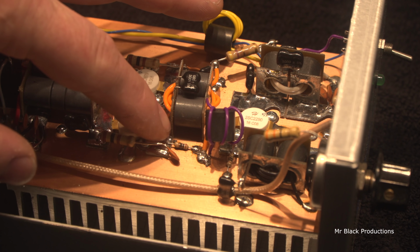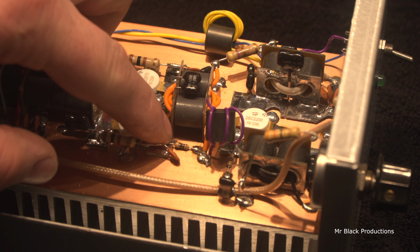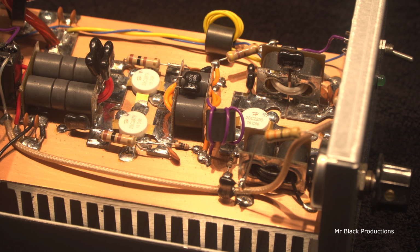But the electrical smoke indicator, this resistor right here, has gone bad. Now, if you've been around this game for a hot minute, like more than a week or two, somebody will inevitably come along and say, oh, the 10 ohm smoke came out. What they're talking about is this 10 ohm resistor destroying itself after the transistor goes to ground and opens up. The smoke comes out and the transistor is no longer working. 10 ohm smoke is a direct representation of the transistor being popped.